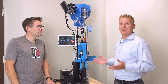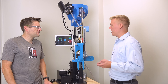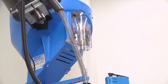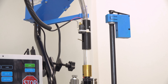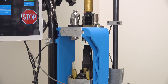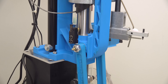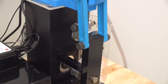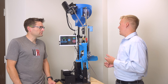He needed a way to make ammo faster, so they developed the auto drive for the 1050, and it has also been scaled down. This is actually a brand new Dillon 750 with a Mark 7 Pro auto drive, capable of loading rounds up to around 1800 rounds an hour. I have it set up here in 45 ACP. It's going to process a little bit of brass for you, but same core technology — same digital motor torque sensing technologies. It knows where it is at all times. The ability to put sensors in, not as much as the Evolution or Revolution kind of line, but definitely still enough to make progressive automated loading safer and more accurate.